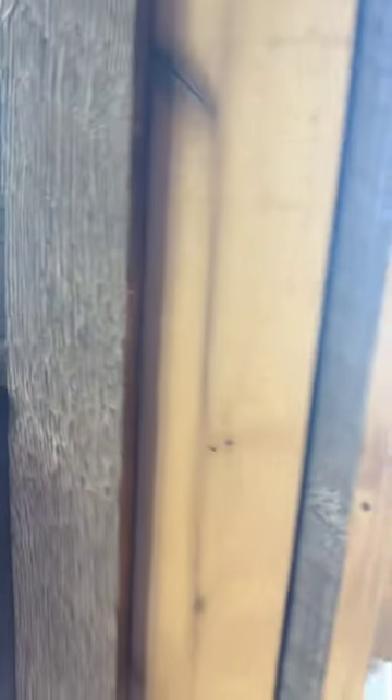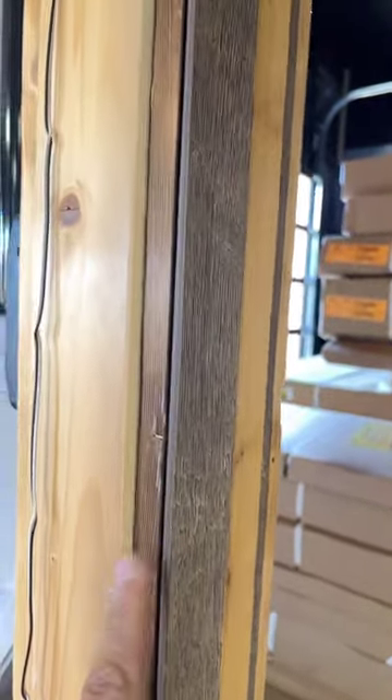The other one we have is custom, and this is actually wood stop. What we do is take a vinyl piece and kerf it in to the wood, staple it so it stays taut. This is for a lot of custom doors that get the wood overlay — we can have the same look and aesthetic with our weather stripping.